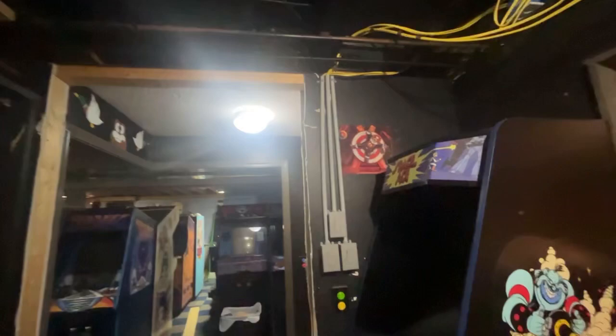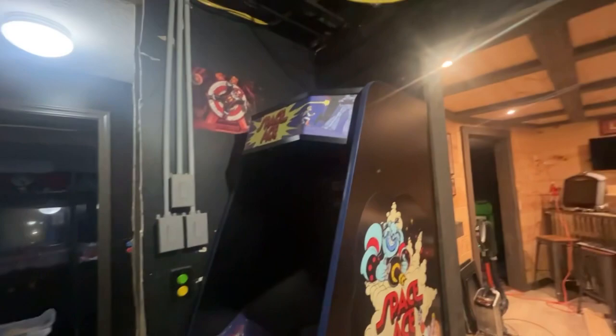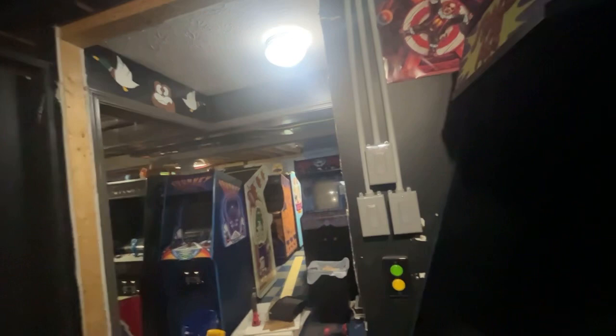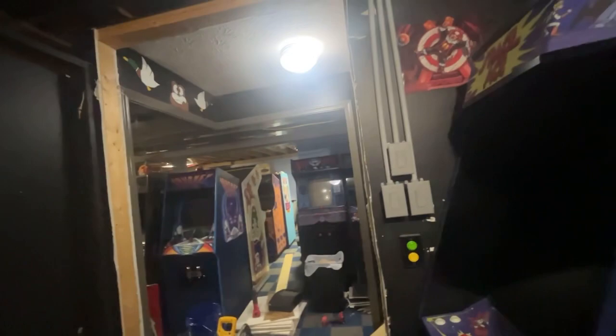There's also going to be a regular light switch right here — that's going to be the main lighting in this room. There's a lot of electrical to go through and change and move. All the switches and plugs I'm using are 20-amp switches and 20-amp plugs so that I can run a 20-amp breaker. It seems like almost all plugs and switches are 15-amp anymore — it's getting hard to buy 20-amp plugs and switches. So they'll all be on 20-amp breakers, 20-amp everything, 12-2 wire. I want to run eight games per circuit, and in my opinion that's going to be running about 15-16 amps out of the 20. I don't want to push my luck and try nine games per circuit — I feel comfortable with eight per circuit.